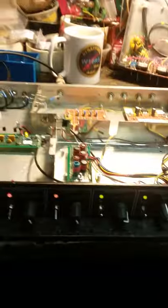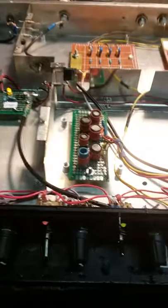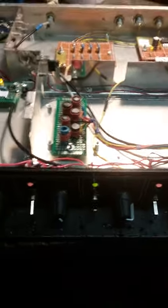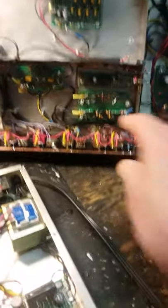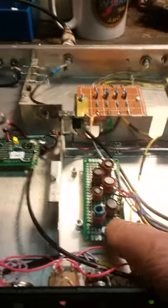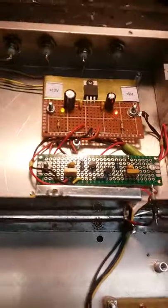This is basically the same thing with the addition of multi-band capability for the pre-selector. We've added that, and we've eliminated the broadcast band filters that were in the previous version. This allows him to zero in on his station and get rid of — if he was near the tower — any FM or other AM signals in the near field that would clobber the system. This actually ended up being 48 dB of attenuation. We're going all-band now, down to 10 or 20 kHz, well into the VLF band.